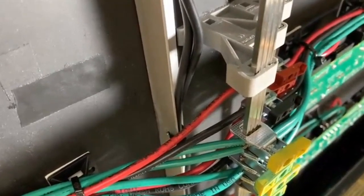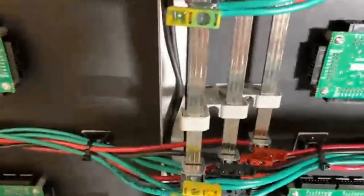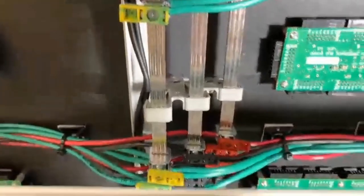Yes, they're literally carrying the voltage, and I've had a few users fear for my life because of this. I did put ground on the one closest to me. So if I do something stupid and put my hand in the system, at least I'm going to hit ground before I hit the power rails. But I do have to be careful. Yeah, there've been a few comments about the general safety of some of the open mains connections.